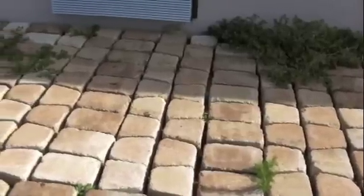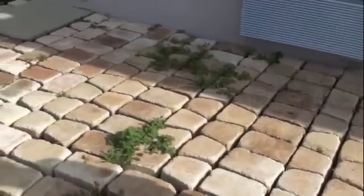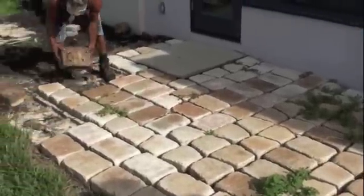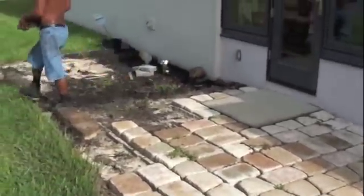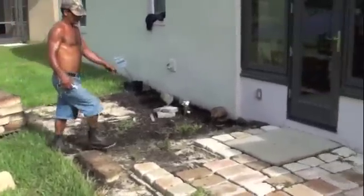We're going to bring in some fill to bring the patio level up where it should be, crushed concrete for a base for our new paver patio. We've got to get sod cutters back here and get this sod cut out for the walkway and the second patio. As soon as Julio gets us on pallets, we're going to get it out of here and then go on to step number 2.